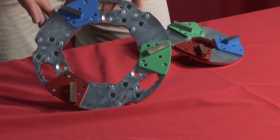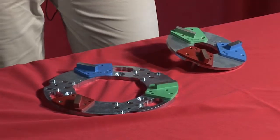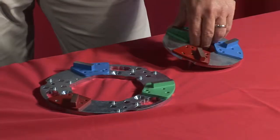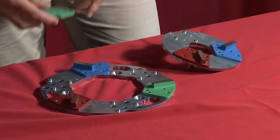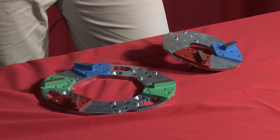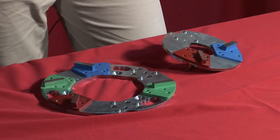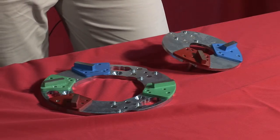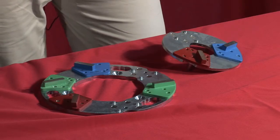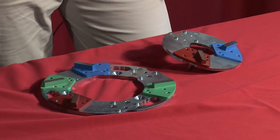Single segment diamonds can be used on a large diameter tooling plate to apply a lot of head pressure for removal type projects. In some cases, these diamonds can also be applied to the plate to allow for six on a diamond head to do some really aggressive removal. Single segment diamonds simply provide a lot of head pressure for removal — ideal for small machines with light head pressure, and sometimes used for larger machines in a larger diameter for heavy removal as a replacement for a PCD or some sort of scraping tool.